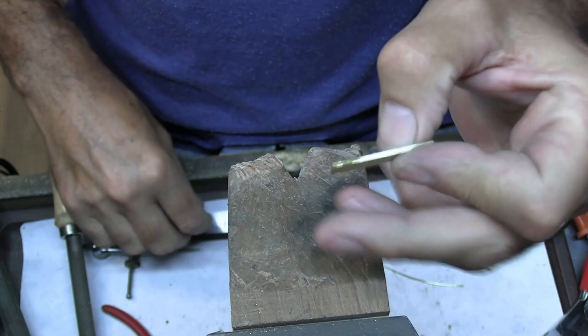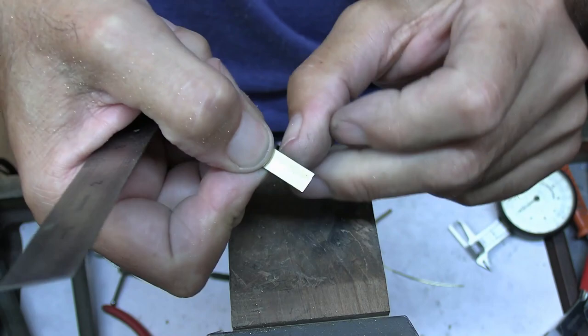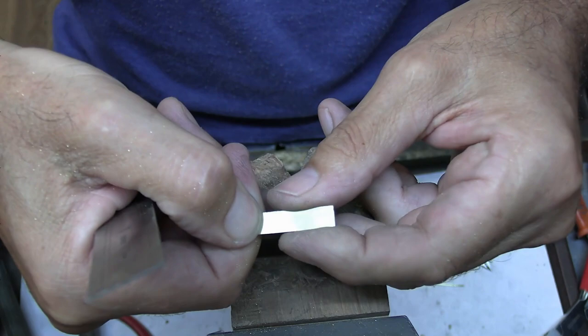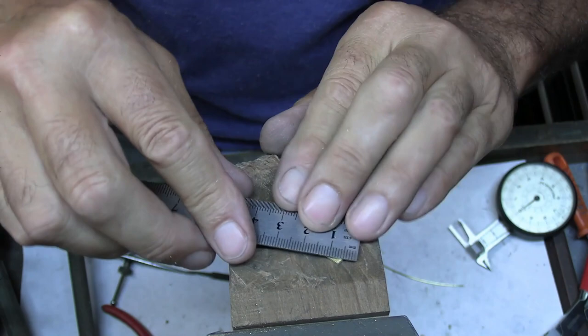The length of this at the moment is 35mm. I'm going to make the body of the catch around about 14mm — that size I think would be suitable for that chain. What we need to do is double that: we're going to fold it over, and we need a piece in the middle where you're going to bend it as well, so around about 5 or 6mm for that. So I'll just mark off 14mm.